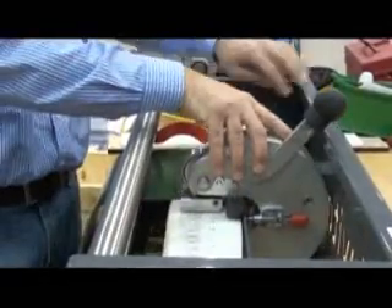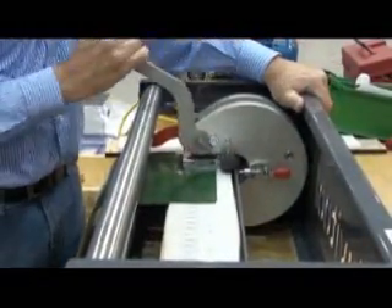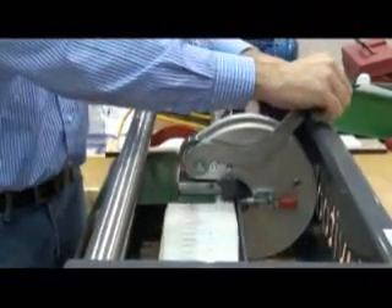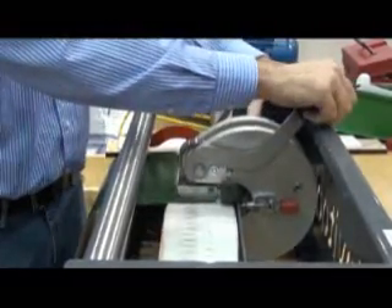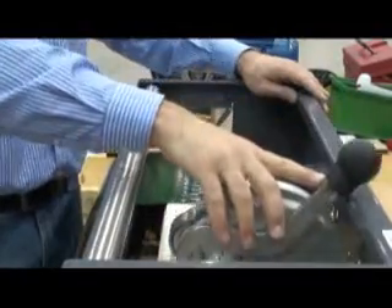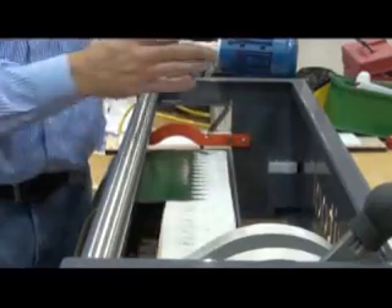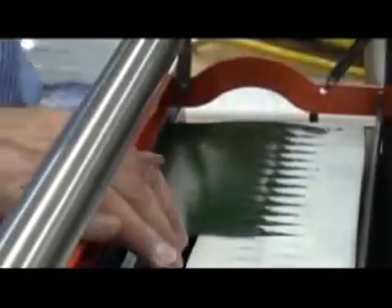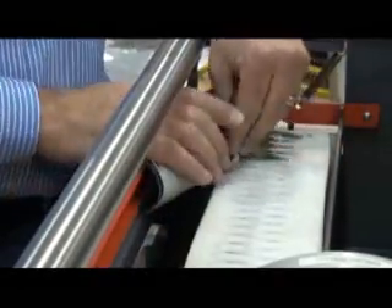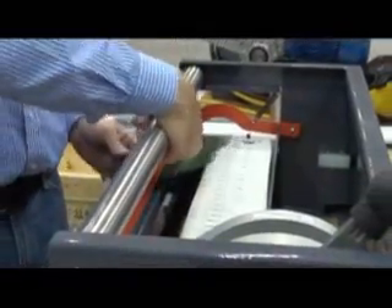Punch the fingers in the uppermost ply across the entire width of the belt. Manually remove the punched fingers from the punch board. Again, lift the remaining fingers. Rotate the handle to unclamp the belt and remove it.